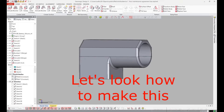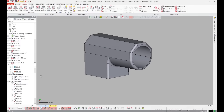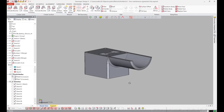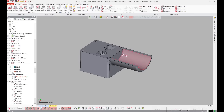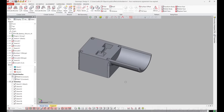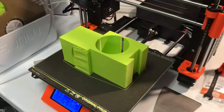Here's a model that I made — it's two parts. It allows you to connect to a Ryobi battery and uses a standard Ryobi clip, and you can put different sockets in here. In this case I'm just going to put a 12 volt cigarette lighter socket in here, although it's actually going to run up to the 21 volts that the battery will go to. I have another video that I'll put a link above to. This is my first prototype.